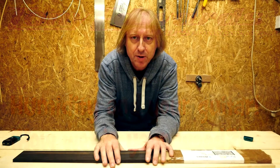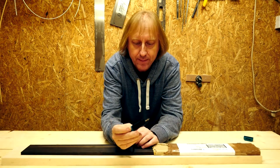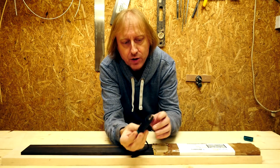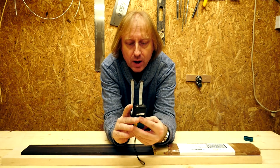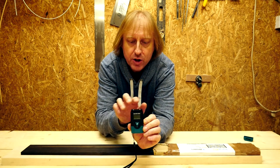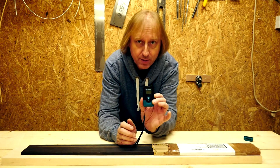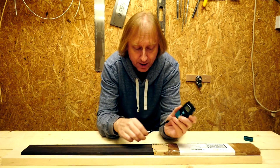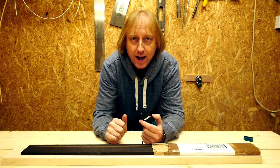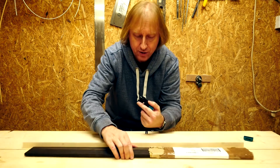I've got a couple of bits of wood to show you today and wanted to talk to you about humidity. This is a humidity tester for woods — it's got two pins on it and what it basically does is measure the resistance between these two points, plotting that against what it understands to be the humidity of the wood, because moisture will conduct electricity and wood doesn't.